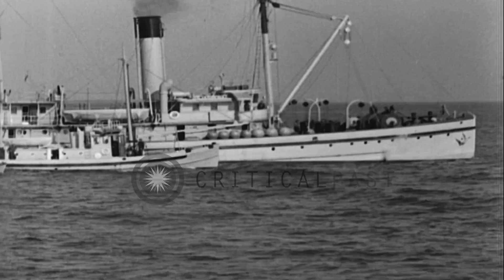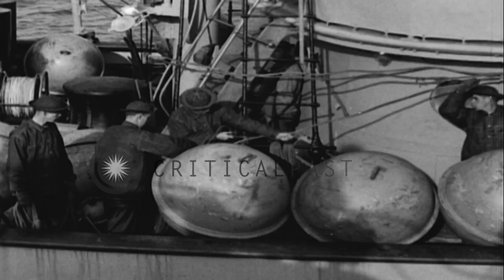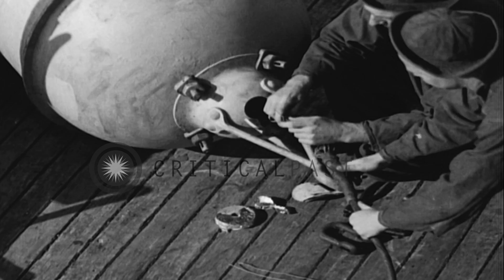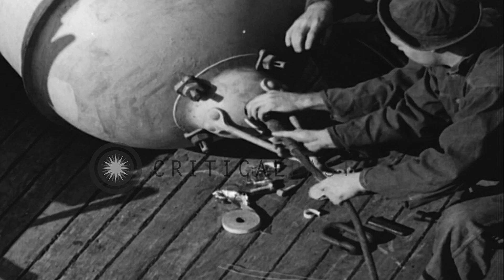Number 10 mine is always planted first. It is prepared for planting by the port detail, normally consisting of eight men. The cable for number 10 is brought to the mine and connected to the loading wire by means of a watertight joint made in the same manner as was shown for the shore cable. The turk's head on the cable is clamped to the mine cap and the cable is lashed to the mine bale with a heavy galvanized wire.